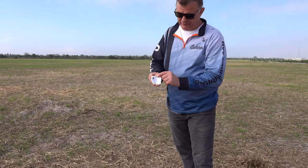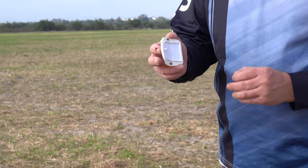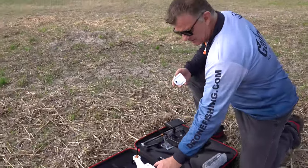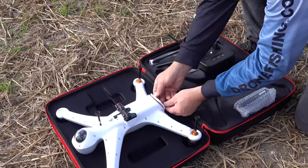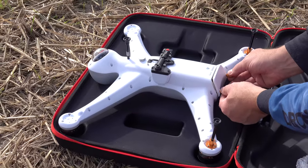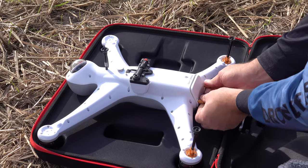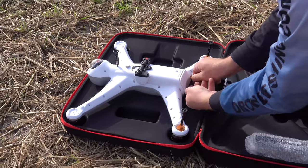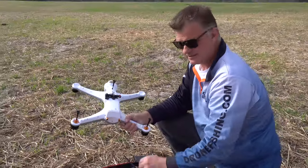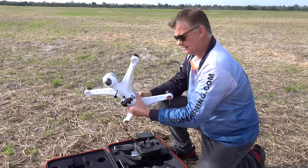On this little cap you'll see there's a piece of foam and then rubber — that's to make it airtight. We also use it for watertight testing. Screw it in nicely, making certain there's no contamination or sand on it. Don't go too overtight — you'll strip it and then it won't seal properly. Go through the whole little hatch. Everything looks 100% — I'm happy with this.